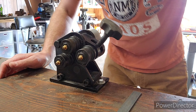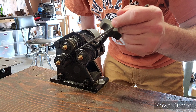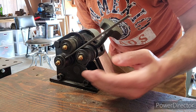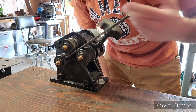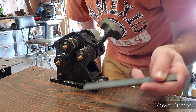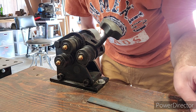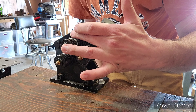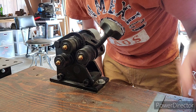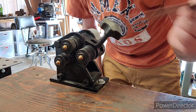For those who are not familiar with a ring roller, it's a very basic tool. You insert your steel into one side, turn this crank, and it feeds your steel into this machine, comes out this way, and puts a roll in your steel. This works with both flat steel and round stock. Now these knurled rollers have a surface here that is rounded and that is for your round steel - fits right in there. Flat steel just goes right here.